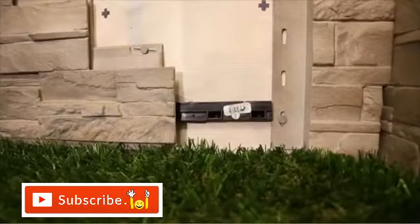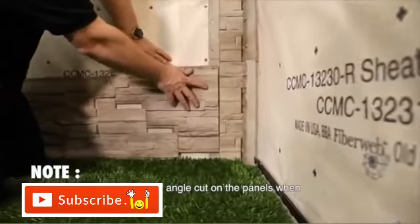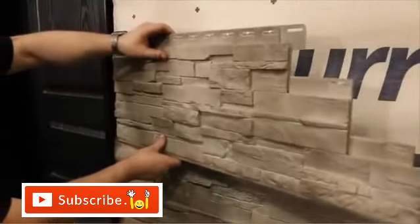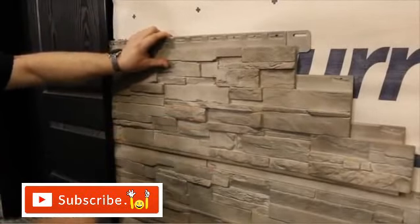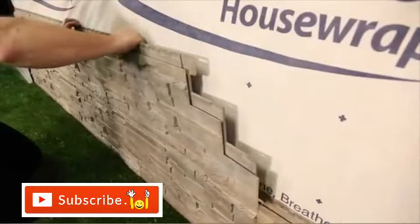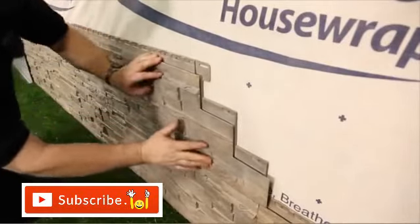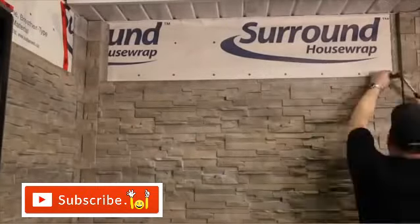Make sure you carefully measure the cut on the last panel so that it fits neatly with the corner. If using trim, leave a gap of about 1/4 inch. Start the second row by cutting the first panel with a 16-inch increment from the cutting line of the first row. Slide the bottom of the panel onto the continuous slot on top of the previously installed row. Proceed with this row and subsequent ones, taking care with each new row to alternate the position of the cut on the first panel.